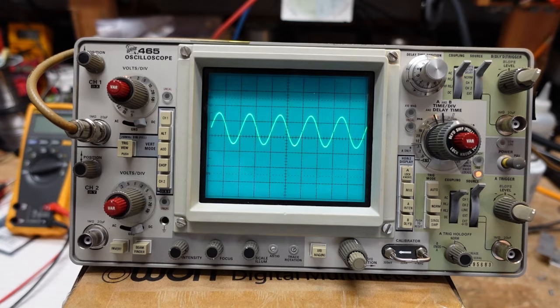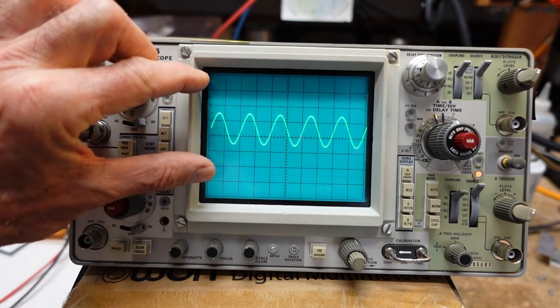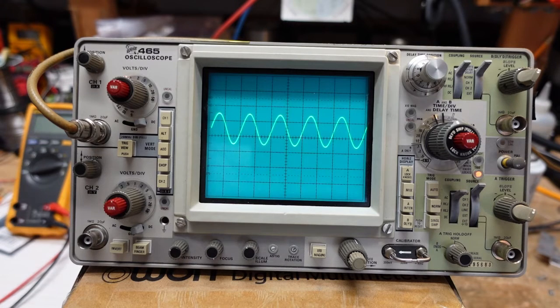I've worked on a fair amount of these. I'm a little embarrassed to get caught out on the low voltage power supply, but the high voltage readings threw me off. One problem taking a high voltage reading on this is that in order to get down into the connector — it's about that deep — the tip of the probe is too short to quite make it, so I was getting unrepeatable results anywhere between 5 and 12 kilovolts. The real point to take away is I've never seen a multiplier do anything but short; if you're getting any kind of high voltage out of your multiplier, it's probably good — need to look elsewhere.